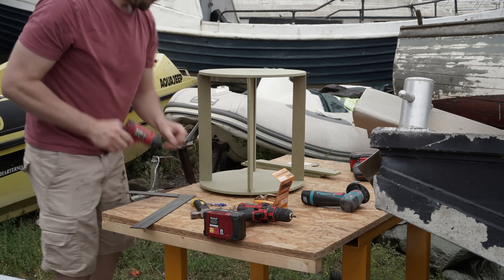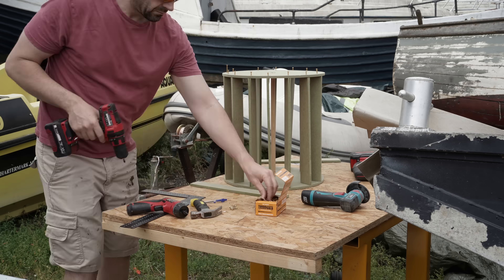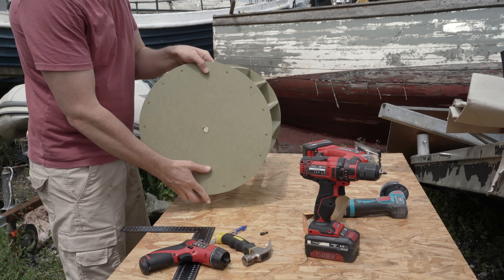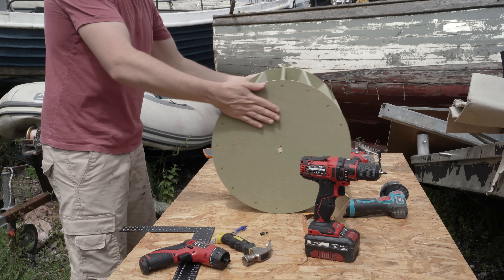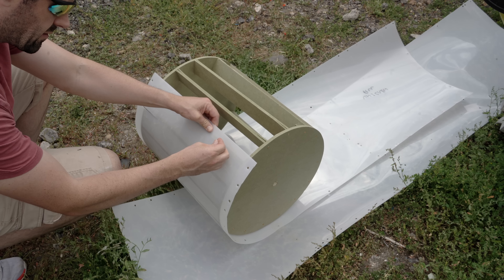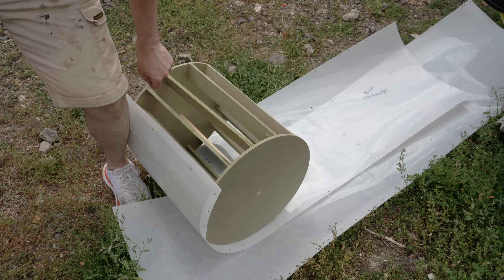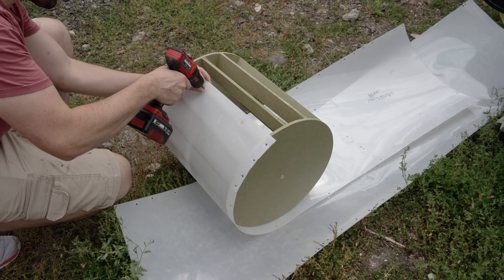I'm fairly chuffed with today's creation — for the first time we can get a sense of the wheel dimensions. The diameter is of course spot-on, though the width of the eventual wheel is a little narrower than this form shows, as you want spare wastage either side for a clean lamination and cut. These wheels are wide — even with squishy rims, we need sufficient surface area in contact with snow and ice to apply a low ground pressure, otherwise the sledge will sink into powder snow. The HDPE sheet from Bernard's mold is now pinned on and wound tightly around the cylinder.